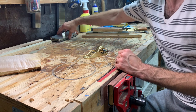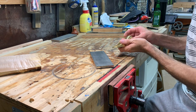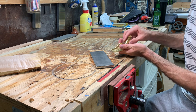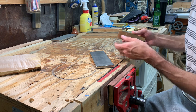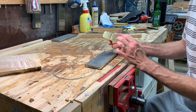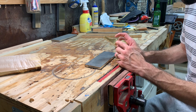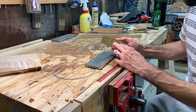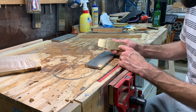I'm actually just going to start out doing that on my extra extra fine diamond stone. I'm going to retract the blade all the way and then put some tension on it, because I want that tension to be on it whenever it's touching an abrasive surface, because there can be some flex in the body on any plane.